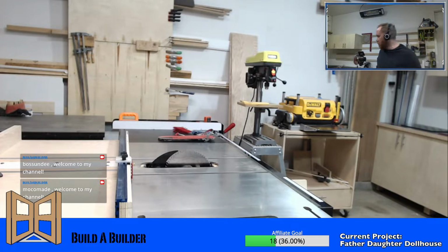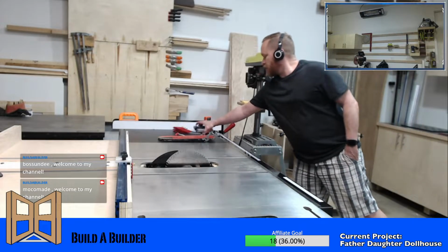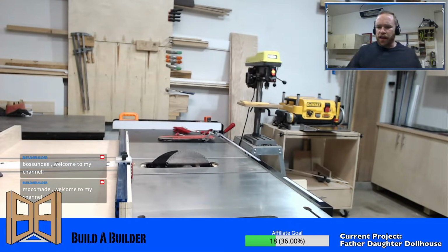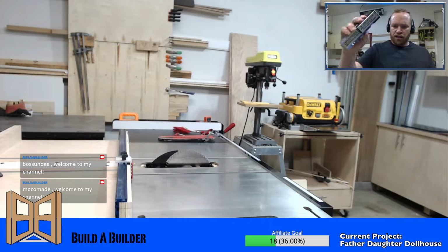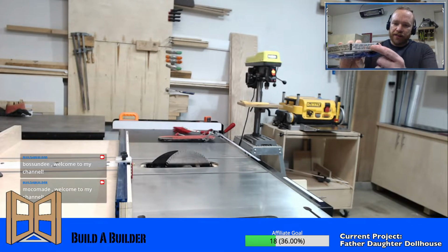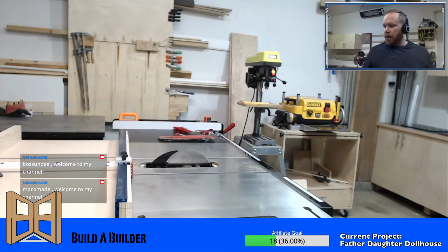What I'm going to do tonight, one of the first things I'm going to do, is replace a SawStop brake cartridge. I went out to the shop, what was it, yesterday, day before, and went to turn on my SawStop over here and it wouldn't turn on. I looked at the lights and noticed they said the brake cartridge had been activated, but the saw wasn't even on. Then I opened up the insert, looked in there, and sure enough, the brake cartridge was pushed up against the blade. It didn't go into the brake cartridge at all, just pushed up against it. The only reason I even have scratches here is because I took my wrench and tried to rotate the blade a little bit to see how tight it was up against it.